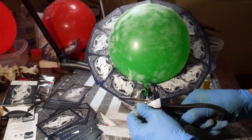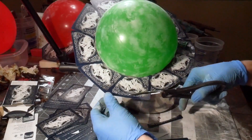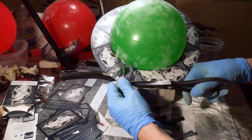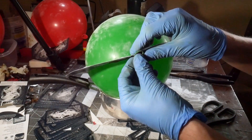I'm making the flange by super gluing the playing cards to the balloon and using baking soda to cure the glue. This is a cool little trick — baking soda cures super glue instantly so you don't have to hold things in place forever. Then the card flange gets a trim to tidy it up and make it uniform.